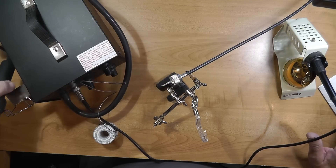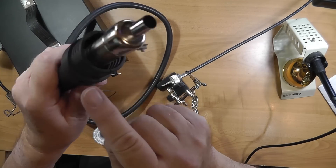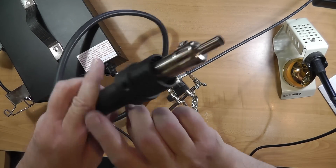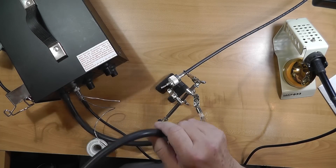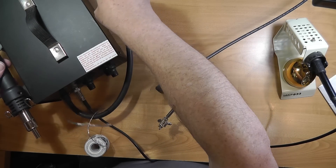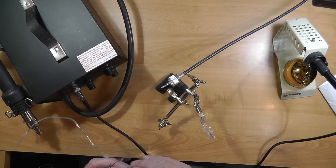This is the heat gun — not your average heat gun. There's air coming up this tube, but the actual heating element is a quartz element up inside. You can get different sizes of little blower tips. When doing work on surface mount devices, you blow on them, the solder melts, then you pick up the device with tweezers. That's why this is called an SMD rework station — it's designed for surface mount devices. If you get the fine tip, you can solder surface mount devices under a microscope. It's also useful for general purpose soldering work.